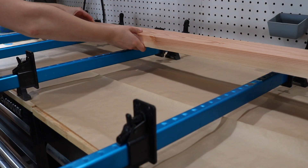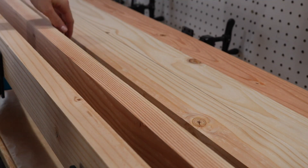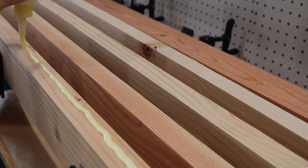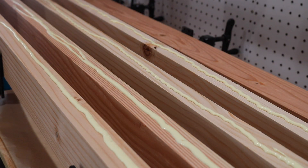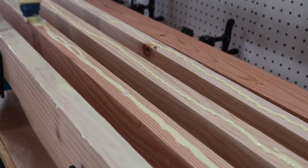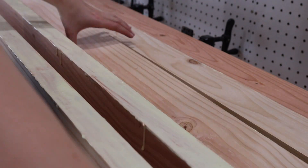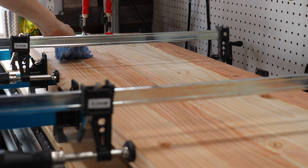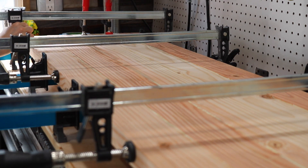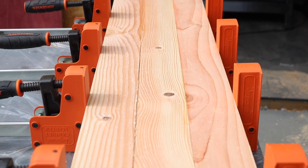I added clamps and began adding all the pieces for the top shelf in one set of clamps and the bottom shelf in another. I glued all five pieces of the top shelf together, but for the bottom shelf I only glued up three out of five pieces — because if I glued up all five, the bottom shelf won't fit on the shelf I build later. I added a ton of glue, spread it evenly with a glue brush, then flipped all the boards onto their sides and clamped them together tightly. As pressure was applied, glue squeezed out of the crevices, so I kept a damp paper towel handy. I also added clamps to the ends to keep the boards straight. Once the top and bottom panels were clamped up, I set them aside to dry and began working on the rest of the stand.